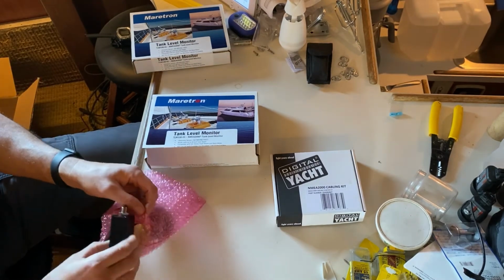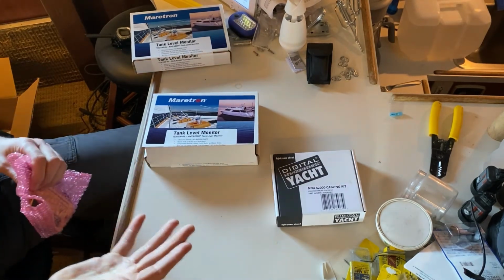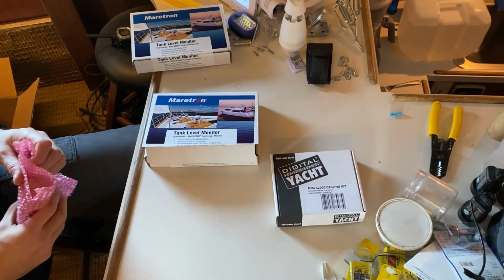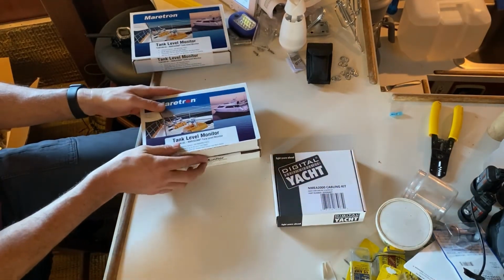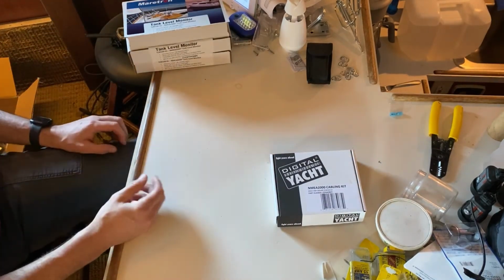It also helps prevent some of the sloshing and going around, because the tank is basically a dip tube that's full, that isn't going to be impacted so much by the fluid motion within the tank. So we're really excited about this. Because like I said, one of my sending units is bad, and if we were going to change them, I wanted to change up to something nice.